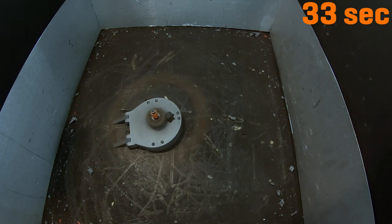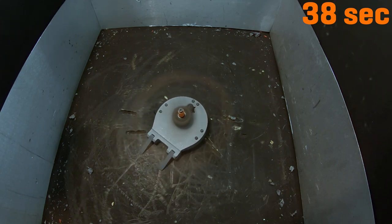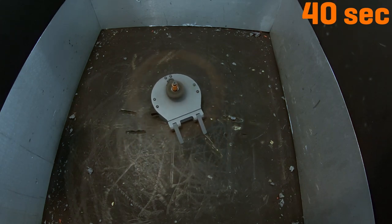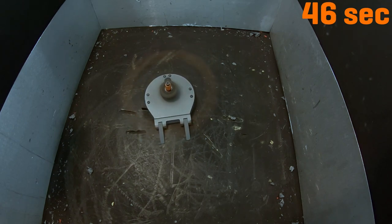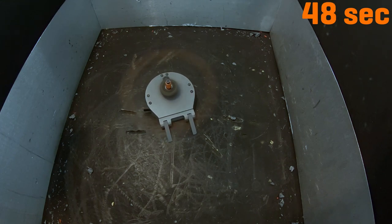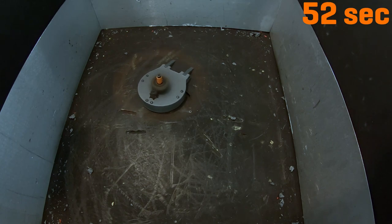Third, the bot doesn't drive very fast. This is an issue I was aware of from the start, but I think in a real competition, it won't be as big of a deal, since an opponent kinda needs to drive into my bot to get at me, so they can take care of all the forward velocity that's needed for bite. It wouldn't be worth the intensive redesign needed to fit faster drive motors in place of servos, but I might be able to look into faster existing servo models.